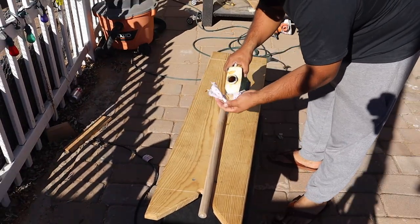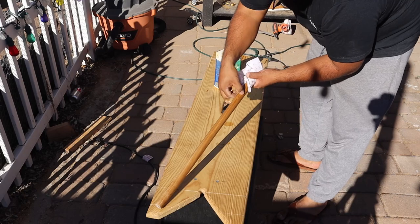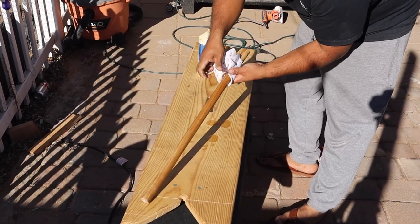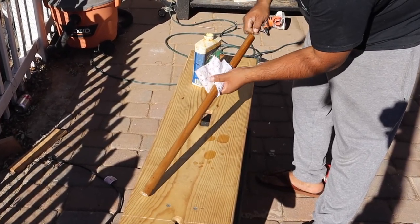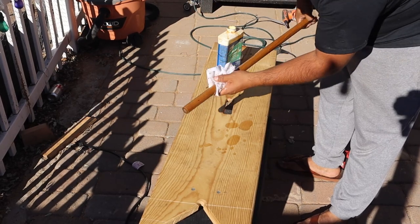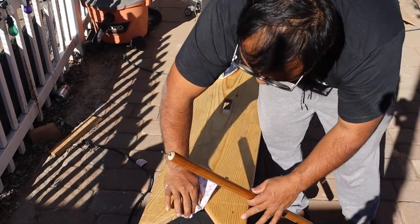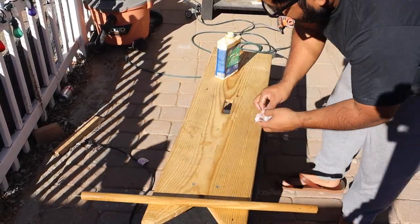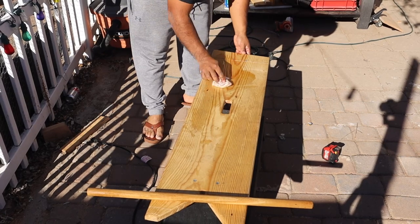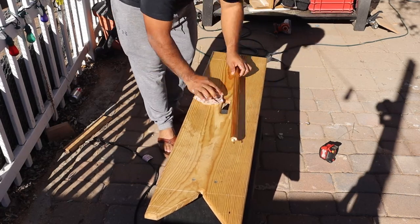To finish my rod, I was looking for poly or lacquer, but I forgot to clean my tip on my lacquer gun, so I'm using boiled linseed oil. The boiled linseed oil is gonna make this poplar pop — if you know poplar, you know it's kind of ugly, but the linseed oil makes it look great. It polymerizes a little, meaning it hardens and reaches inside the wood fibers to protect them. That's also what I used to finish my bench, so I'm giving it another coat.